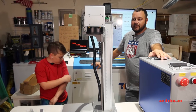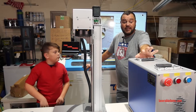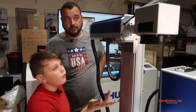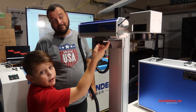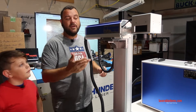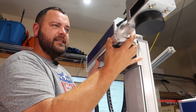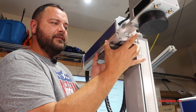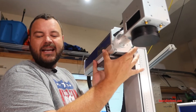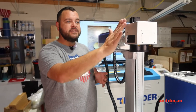So we kind of got everything hooked up for the most part. We don't have any hardware but there's still a lot to do before I even hook up power to this bad boy. So what we were talking about before — a little bit in the last video at the end — about these screws on left and right, front and back. If these are loose, your laser can slide forward, back, left, right, or even out at a diagonal. That's probably not ideal because most everything you do in work holding needs to be square to the laser head.